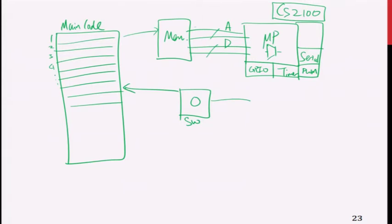Some of these subsystems are internal, but some of the features are brought out as pins. So a switch, for example, can be connected to your microcontroller through a GPIO pin. When I connect my switch as a GPIO input, I must write some software to monitor it. The easiest way is polling, which is what we saw initially. But polling means I'm always wasting time checking if the switch is pressed, which is very inefficient. So the alternative is this new method called the interrupt.